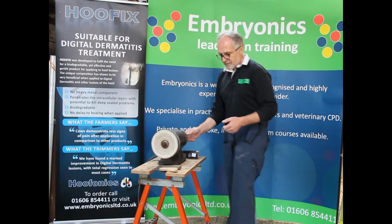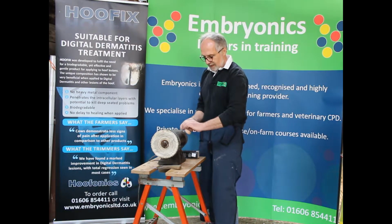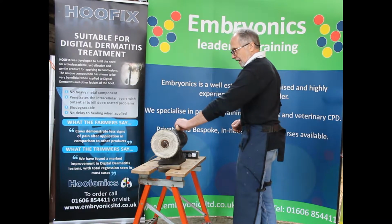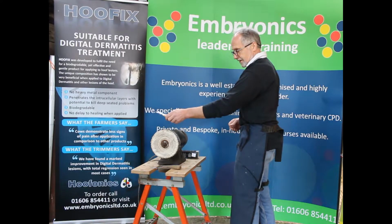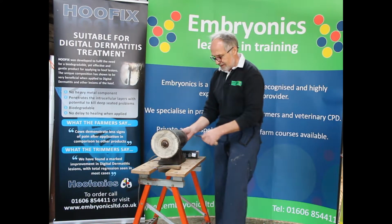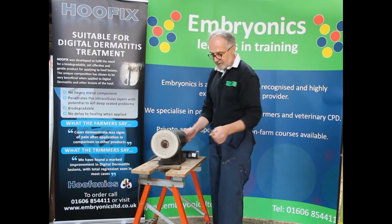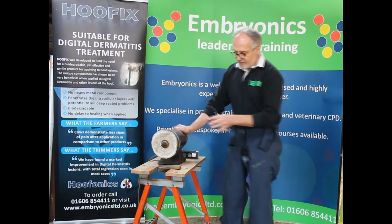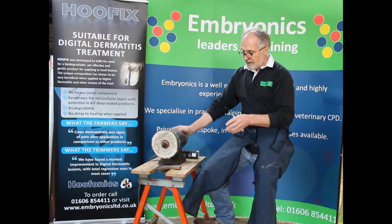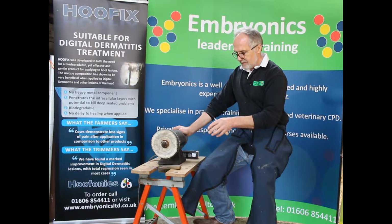The reason it's rotating away from you is that when you start sharpening the knife on it, if you do catch the edge of the knife, it can throw it out of your hand and throws it away from you rather than towards you, if you do catch the back of your knife on the grinder. So that's one of the reasons. Next thing about the grinder is you can see there's no guards on it. It's far easier to sharpen a knife without the guards.